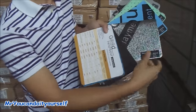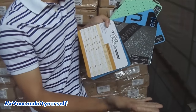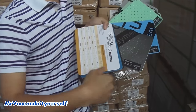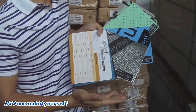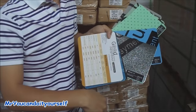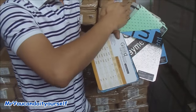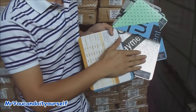And then there are also two types for strata, which are mostly used in strata or condos. They have ratings for IIC and STC. Both IIC and STC relate to sound transmission. IIC means the sound transmission goes to your downstairs, and STC means the sound transmission goes to your neighbors on your left, right, or back when you step on the floor.